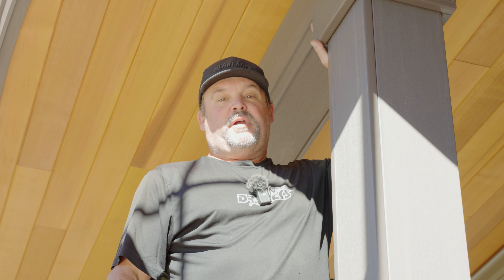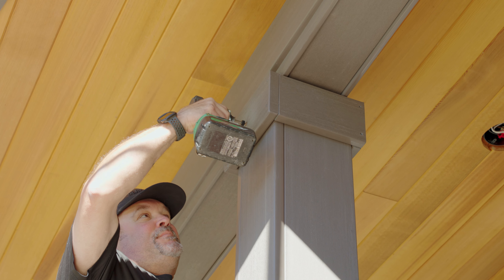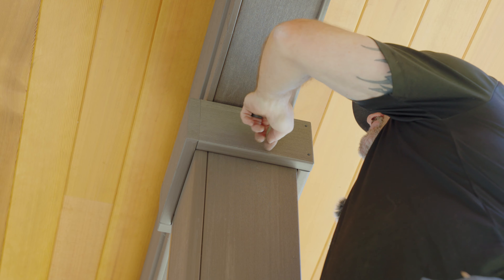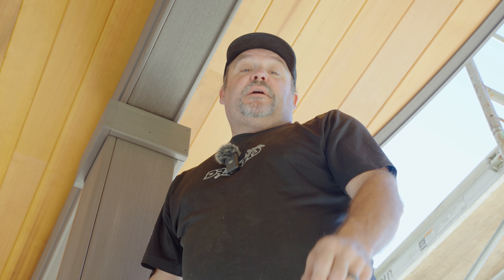Okay, so I have this where I want it. It's in place — I just need to put screws on two sides to keep it together. I don't have to put a screw on every side of the column. I'm going to put one right in the middle here and we'll cortex that later. On this side I have to be careful — I know there's a metal bracket that hangs down about two and a half inches holding this beam to this post on the inside. So I'm just going to hang this screw down a little bit lower to make sure I clear all that. Then all we have to do is put in our cortex plugs and that column top will be done. Thanks for watching — that's really all there is to it as far as giving a little more detail to a post and making a wrap post look nicer with a column top. We'll also put a base on the bottom. Don't forget to hit the subscribe button and the bell icon if you want to be notified when we put out new content. Leave us a comment below and let us know what you think of this detail. Thanks for watching, guys — have a great day.